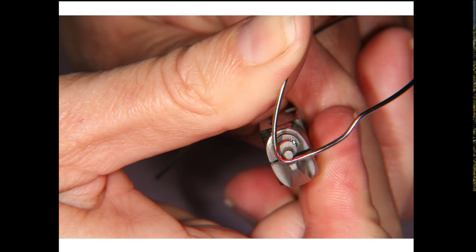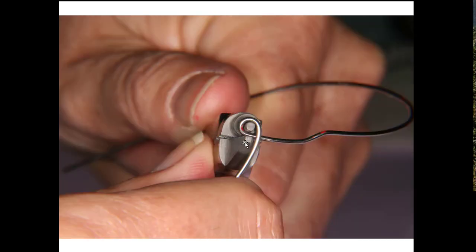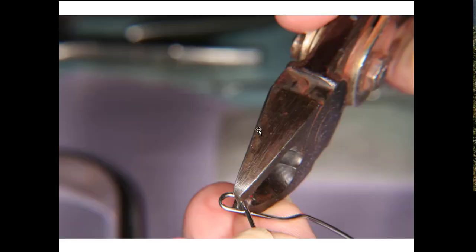And now I haven't shown you how we make the little circle in this wire. This is heavy stuff, see, and you bend it around that, and you're going to come out with a little circle about like that. And you pull this thing down, and when you get about here, we have a groove back in that plier, and we're going to open that plier up. Well, this one, we just bent it down there, and then you cut it off, and then you've got to mash it together. In one place, I showed people how to crimp it.